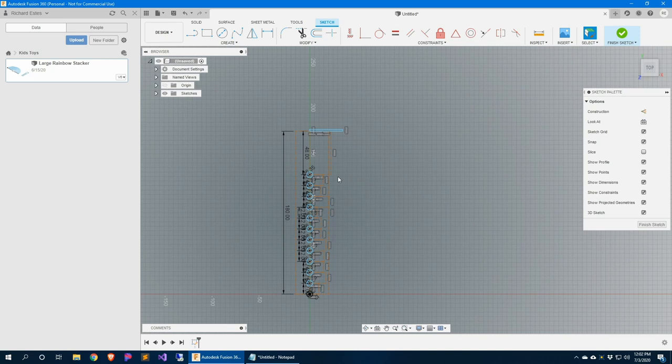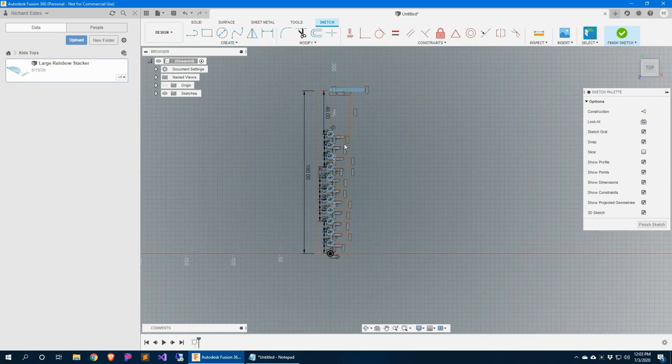What else do we want for the base? I want guides on either side because I'm going to actually have a bottom piece that pivots and that gets to the top. So let's go ahead and, I want that to match up so it goes right up to the blade. So when I'm cutting that last final piece, it actually will act kind of like a zero clearance. So that's going to need to be 48 on either side.